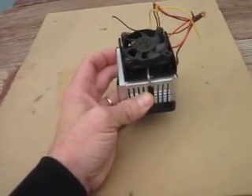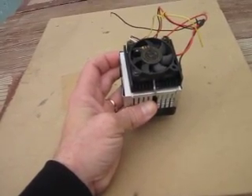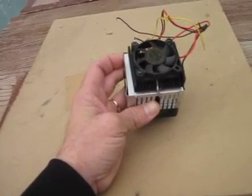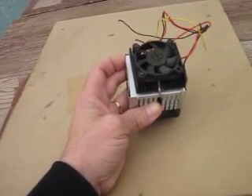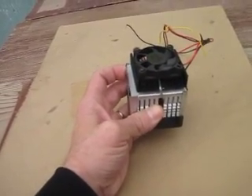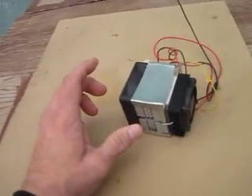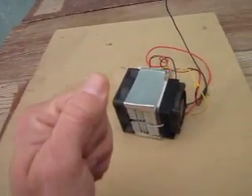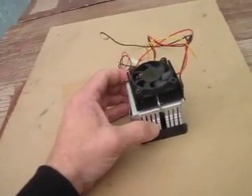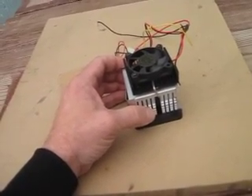Use what you can, but keep in mind both voltage and amperage need to be controlled. Now when I say regulated, I don't mean by use of a regulator, because you need steady DC. You do need steady DC in all of these devices — any device that uses DC, do not put unregulated DC in there because it'll blow it. It's been a rough couple of days for me; if I seem impatient and snappish, that's why.